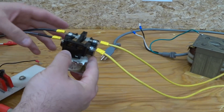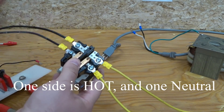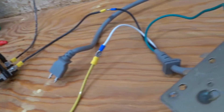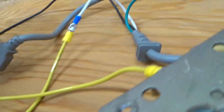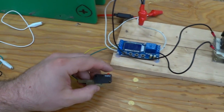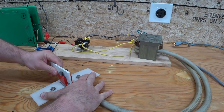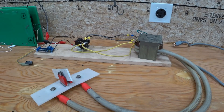I put wires on both sides of this relay even though we're going to be working on 120 volts — figured might as well since I've got it. One side of the contactor I'm going to run to the plug, and the other side we'll run to the transformer itself. For testing I'm going to put a piece of plastic between the tungsten tips and plug in the 120 volts.